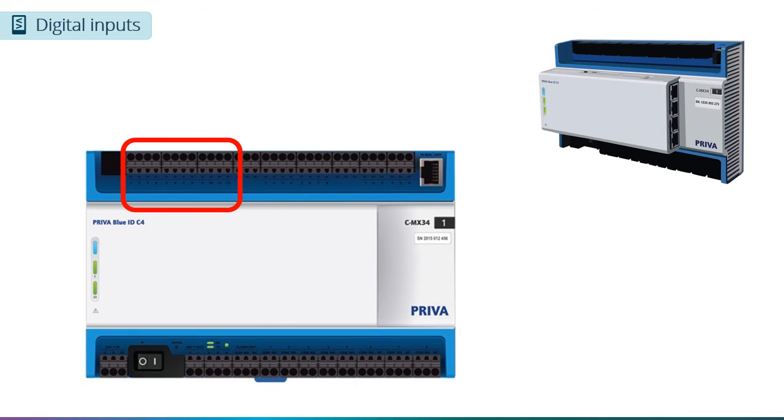There are also 12 digital inputs. These can be used to detect a status feedback based on a normally open or normally closed contact. They also can measure pulses to allow you to connect to different flow sensors. For flow sensors, we recommend the Signet paddle wheel flow sensor. The sensors need to be connected between the input channel and the field ground.